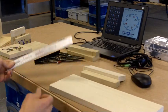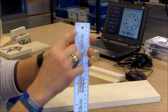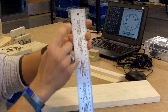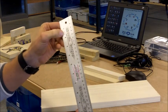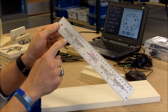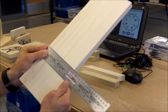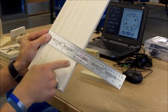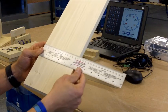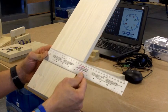This block of wood should be about five and a half inches. If you look at your ruler, you've got inches on one side and millimeters on the other — I'm on the inch side, the one that says one through twelve. You've got little lines representing a sixteenth of an inch, so there are sixteen little lines in every inch. Lay your ruler down with zero on the end and your block should be right around five and a half — sometimes it might be one sixteenth past five and a half, so double check. On this one it's five and nine sixteenths.